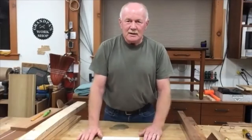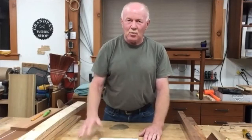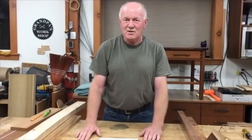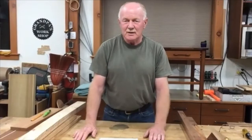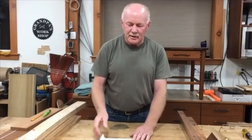So I never cut it that close. If you're buying rough sawn boards, yes, they should have been one inch thick if it's 4/4 when it was milled. It probably has dried since it was milled, so it's probably a little less than that. By the time you joint one face flat and plane the other one flat, you're likely to be really close to 7/8 of an inch, and you haven't necessarily dealt with any adjusting that's going to happen after you sticker and stack the material to let it acclimate. So I always bump up an extra quarter if I'm coming anywhere close to, say, four quarter. If I need 7/8 or 15/16, I always go to 5/4 material, and likewise on up the ladder. But don't cut yourself too short. Bottom line.